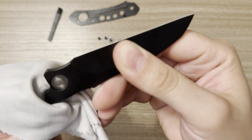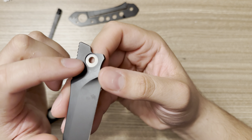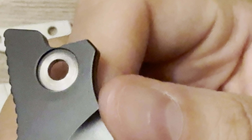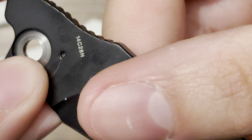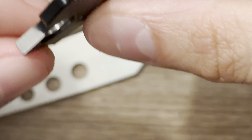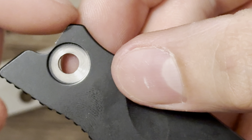I'll get a better look at the machining of the blade overall — that's something I intend to do a little bit more often. So the surface of this is semi-polished, but if you look down in there you can see there's still some of that black coating still on the surface. Not the biggest deal — it's like a little shadow, nothing crazy. Check out that detent hole right there — nice and well machined, it has the tiniest little lip around it. Nice, I like that little touch. The detent track is already worn in a little bit, right on the surface — it'll get smoother over time. Lock face geometry: that looks beautiful, very healthy, not choppy, not scratched up in any weird direction.